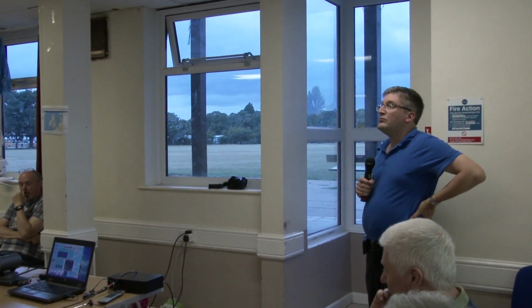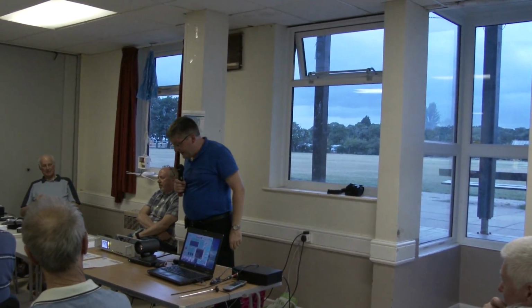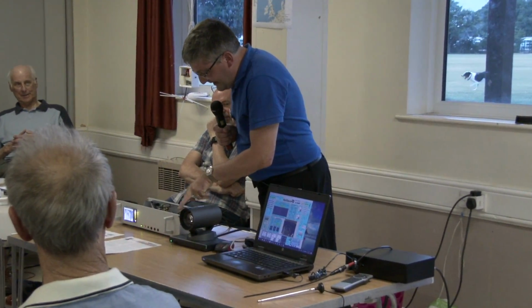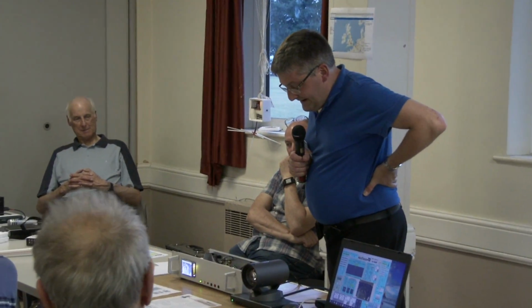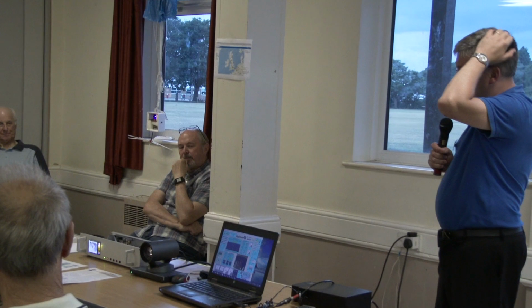Did I hear you say all the RF bits were included for different bands, or is that separate? I think you said 70 to 23 centimetres, 2 metres? Yeah. And did you say 4 metres? Yes. Really? Video on 4? I think you have to have an NOV for it, I believe, but in theory it is possible. It's quite a clever board. You've got various filters for different symbol rates and different frequencies, and it's all controlled over a simple 2-wire binary bus that tells it which thing to do, and that drives the switching of which output becomes active. I've also put in a thing so you can switch coax switches and things like that one day in the distant future.